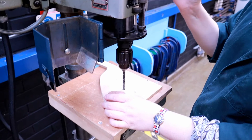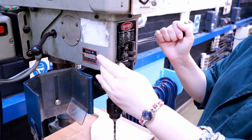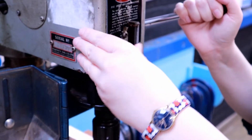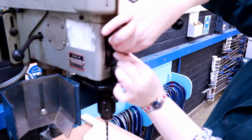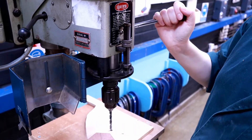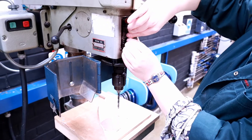With the drill held in position, turn the nuts until they stop — now I know that the drill is going to stop at that point. Twist the nuts into each other so they won't move. Then just double check you're happy with the depth and adjust them where necessary.